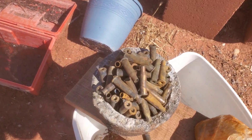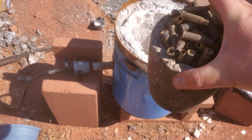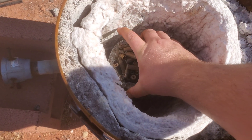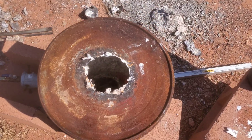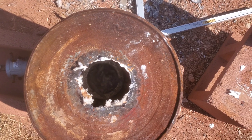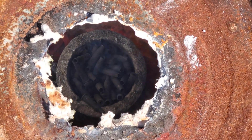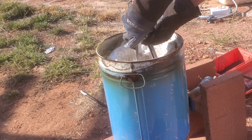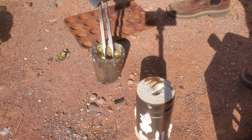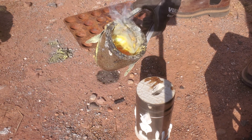All the wax is out and it looks like it's cured, so we should be good to go. We're gonna use these brass bullet casings we found in a shed - somebody used to reload bullets. Always make sure you don't have any live rounds in there, especially if they're given to you from somebody else. Apparently some of them still had primers in, and all of a sudden they started going off - I was like oh no. Time to pour - make sure to clean it out, get rid of all that junk, and then pour.